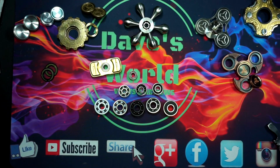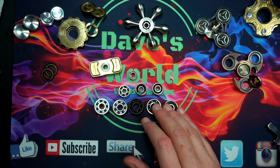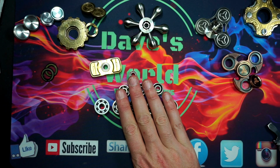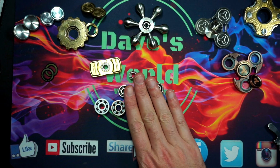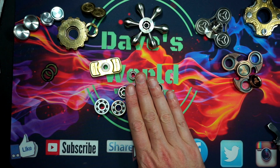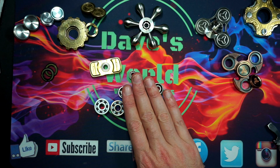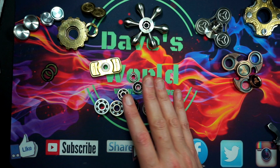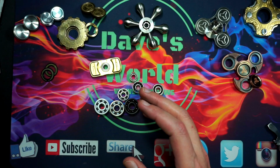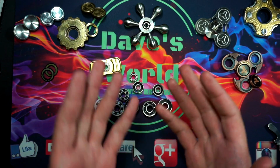All right, so I hope you guys enjoyed that. I just wanted to make a quick video on just bearings themselves. Next video will be breakdown and cleaning in different solutions, be it soap, then water, then an alcohol rinse, cleaning in straight alcohol, cleaning in acetone. What kind of oil did I end up using when I do use oil? And yes, I do in some of mine. It significantly quietens down the bearings, but at the same time, it slows down the spin time. So it's kind of a catch-22.